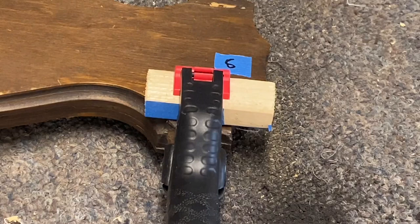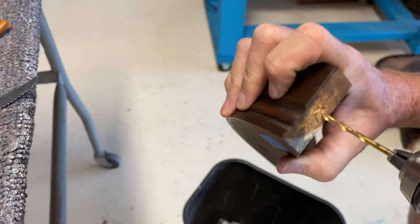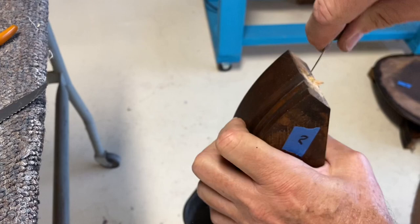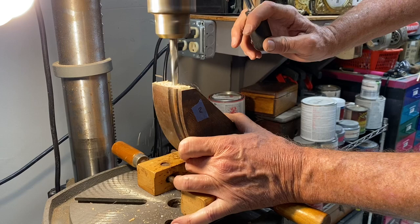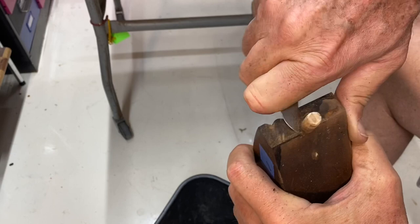I've got a couple of pieces with dowels broken off in them, and there's no elegant way to deal with that — just chew it out with the drill as best I can, then use a knife to get it all out, maybe a pair of pliers too. The dowels are all about three-eighths inch, so I'm going to try to clean these holes out as best I can and make a nice square hole. Every one of these joints has got to be cleaned out; I need to get as much of the old glue out of there as I can.